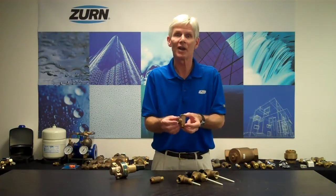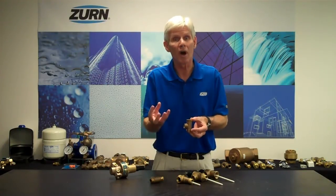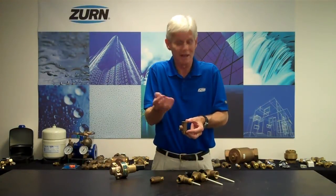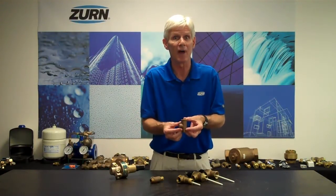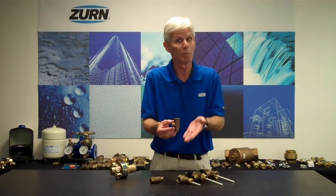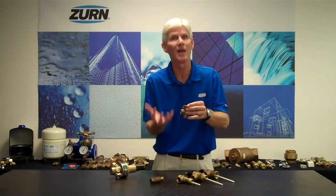I have to instruct my customer to be cautious about that because, remember, the 100-pound relief valve may not close itself until it hits all the way down to 80% of that set value. Therefore, on a 90-pound per square inch system, if the pressure rolls up to 100 or slightly greater and this relief valve pops open, the pressure would have to subside all the way down to 80 PSI before this relief valve would close. On that system operating at 90 PSI, should the pressure rise and the relief valve open, it would never close — it would just sit there and continue to run.